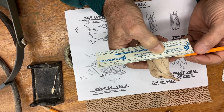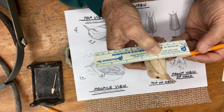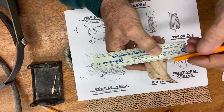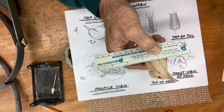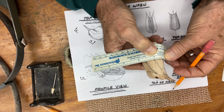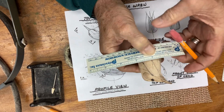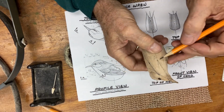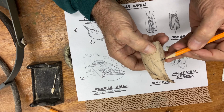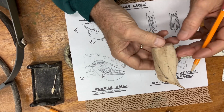And then you look on this side and you get a half inch mark and you put it over on this side. Okay, so they're a half inch out as the crow flies, not on a bend here. If you actually bend it, it's probably more like 5/8. So if you did a wrap from here to here, it would be 5/8. Okay, and from here to here, it's 5/8.